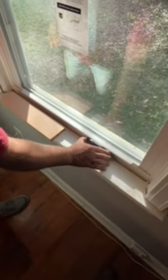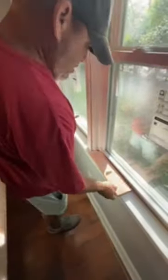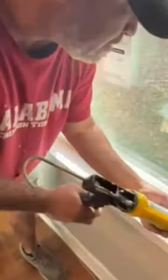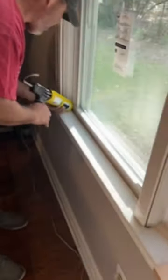I want to use the homeowner's razor knife. What we'll do is cut this tip wider like so. We're not going to try to fill this all in one pass — we're just going to run a little bead on the back, then come back and change the angle of the caulk gun. No backer rod needed; backer rods are a waste of money and never work.